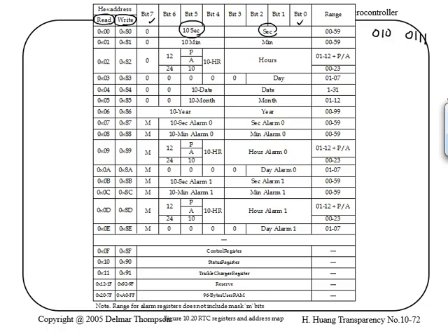This is called BCD — binary coded decimal encoding. The reason they used binary coded decimal instead of plain binary is that if you read it and want to convert it to decimal, you don't have to write a loop that successively divides the value by 10.